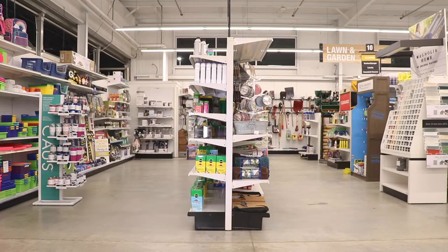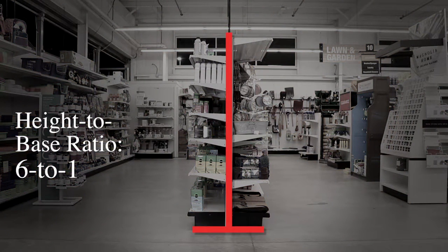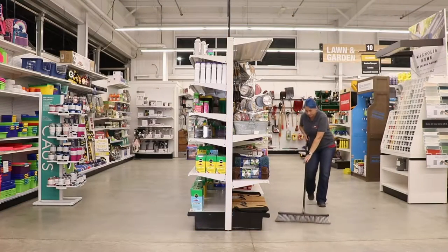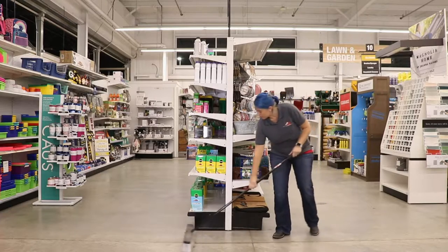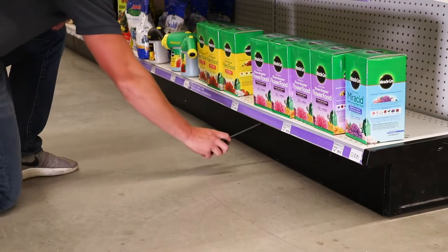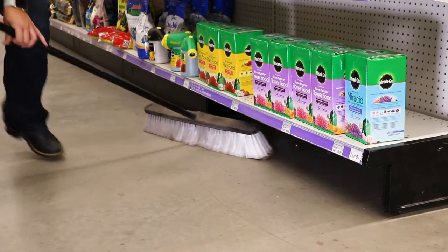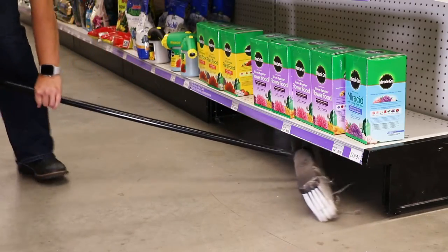The second check is the height-to-base ratio, as this system was not meant to move shelving units with a ratio greater than 6 to 1. The third is to make sure the area is clear of debris, as this will aid in a smoother move. It will also be good to remove the kick plates and sweep underneath the unit, as you will need to remove these pieces for the move anyway.